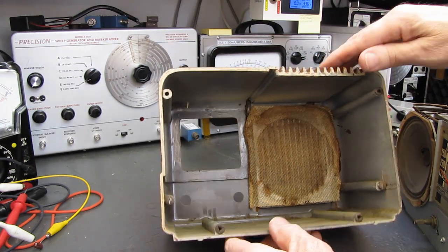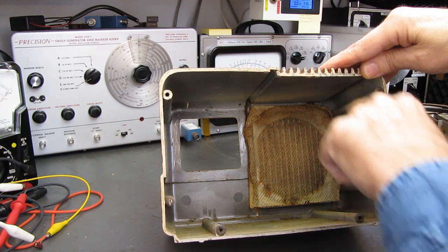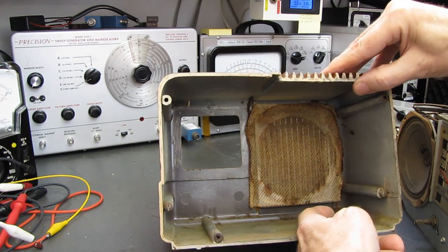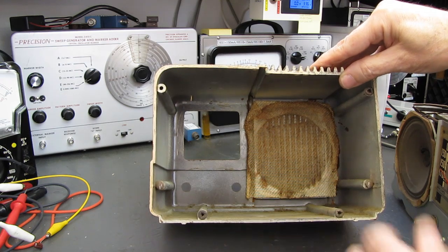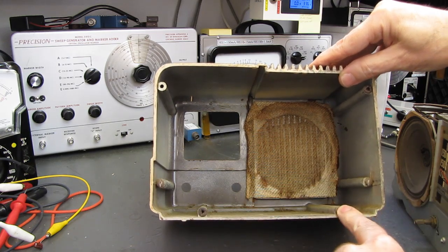The General Electric set had 2 bosses similar to this up on the top for holding the top of the antenna and back in place, and one of them had been ripped out. Half of its length was missing. So what I did is I took a couple of pieces of Lexan and I made like a little form in here and filled the whole thing with JB weld.